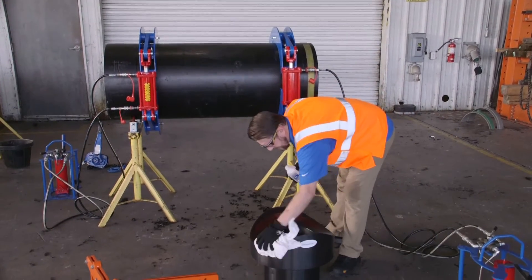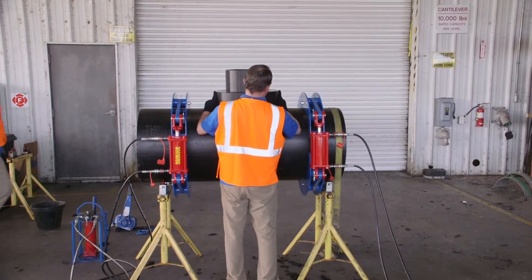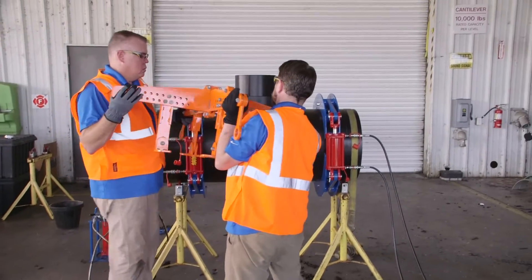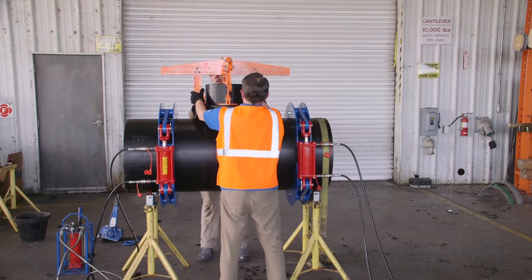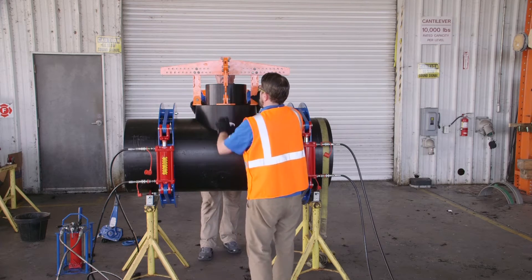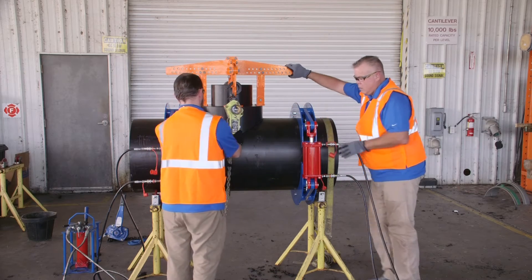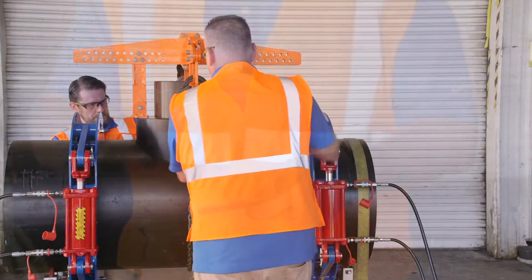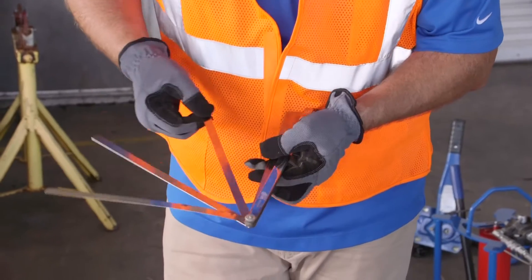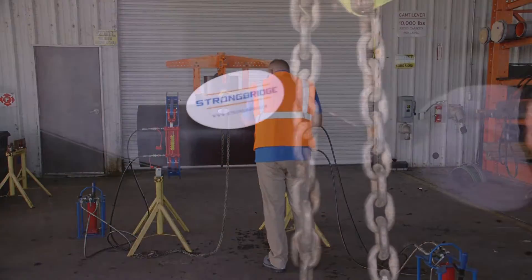Clean the fitting with isopropyl alcohol with a concentration of 96% or greater. Place the fitting on the peeled and cleaned section of the pipe. The spider tool is used to secure the large diameter saddle to the pipe and eliminate any gaps between pipe and fitting. Use a ratcheting chain or strap to secure the spider tool to the pipe, then tighten it to secure the saddle. Use a feeler gauge to ensure there are no gaps between pipe and fitting that may compromise the fitting. Tighten the spider tool as needed to eliminate gaps.